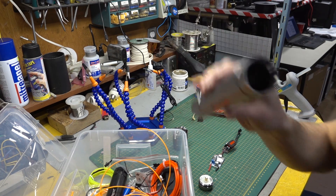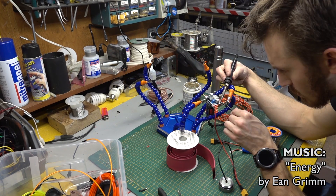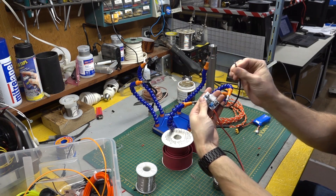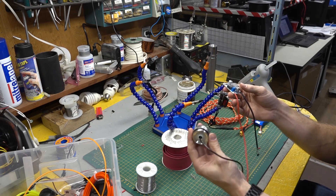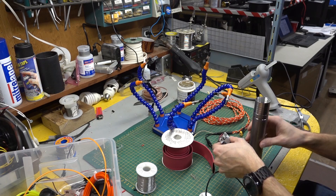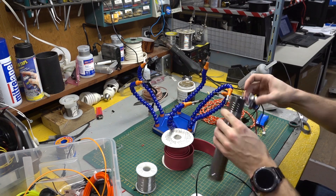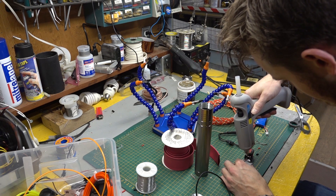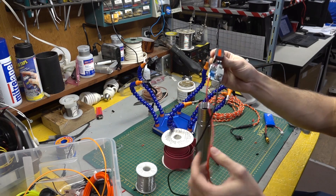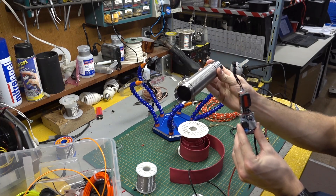Let's take this flashlight apart — see, there's lots of room in there. We've got all the wires connected now. This is going to connect to the frame of the flashlight, and the switch will then make a connection between the battery and the frame, which then powers the buck boost. We're going to cover the circuit in heat shrink tube to keep it from shorting against the frame of the flashlight.